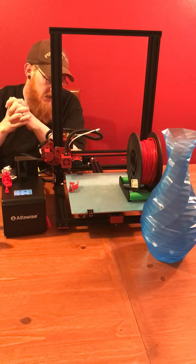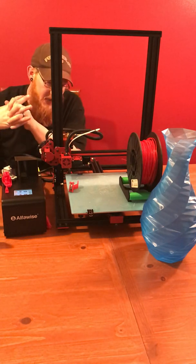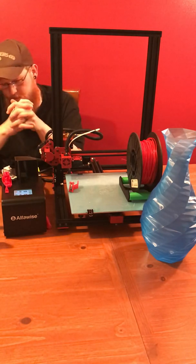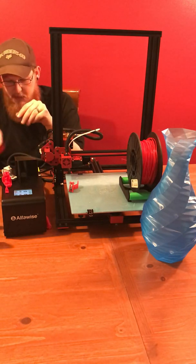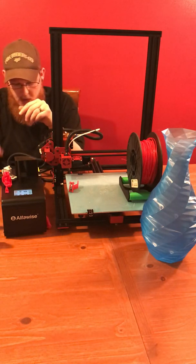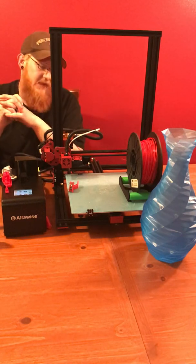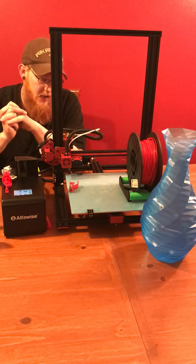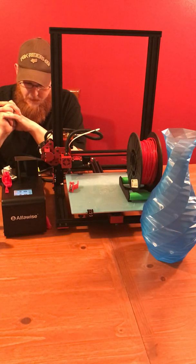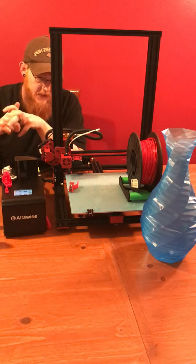For that sheet, I call it quits on that side of the bed. But for this side of the glass bed, I've re-leveled it and it prints absolutely fantastic now. I should go back and reprint those test files, but I deleted them off the SD card. I have printed something with a raft, and the raft came off just fine after that. So I'm thinking it's maybe a combination of the settings on the test files and maybe the bed itself.